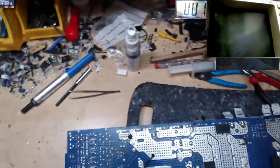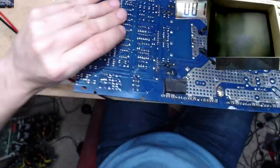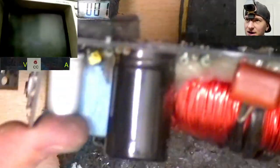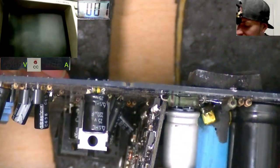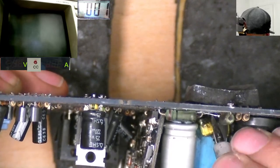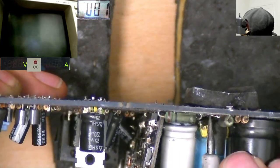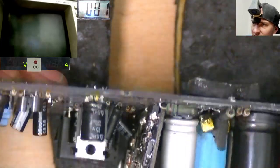The solder might have actually just flowed through then. Let's have a look and see if we can see from the top of the board. Is that little thing that we've just made soldered to that capacitor? Oh, nice, it is, it flowed through, excellent. So that's all good and done. So, move that over a little bit. Now we've got to solder that resistor in.